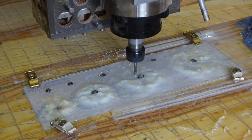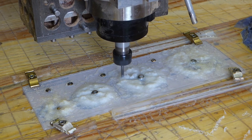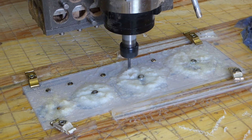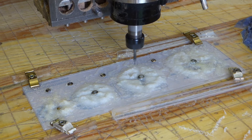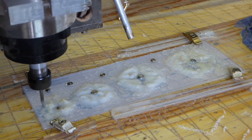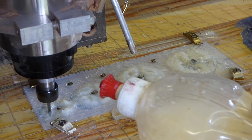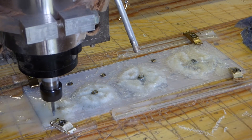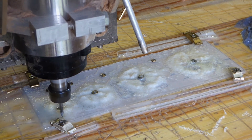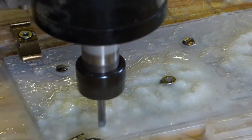Milling at a reasonable speed and using coolant eliminates the possibility of the one millimetre tool snapping. However, notwithstanding this, it turned out that this first effort at milling the gears by this method was not satisfactory. The coolant played havoc with the dimensional stability of the wooden table base, with the result that in some places the tool did not mill completely through the material, and the whole operation was a failure. I show this at the end of the video.